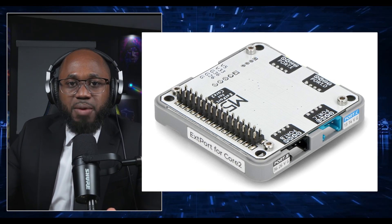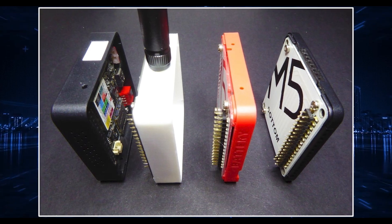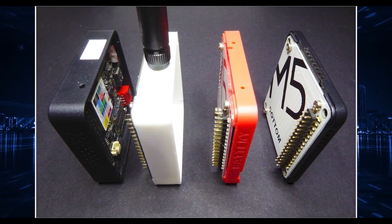There's an external SMA antenna included with the module for optimal range. For firmware selection and flashing, use MeshTastic — an open-source off-grid mesh communication firmware designed for LoRa hardware. Flash the firmware onto your M5Stack Core2 using the M5Burner tool, which is official and cross-platform. The M5Burner provides a straightforward GUI for firmware uploads — select the correct device and port, then burn the firmware.